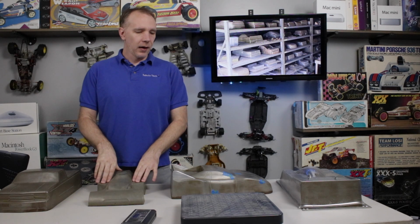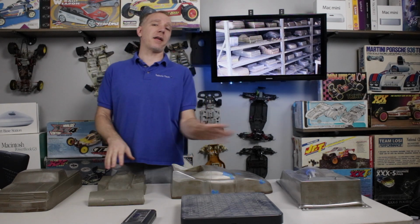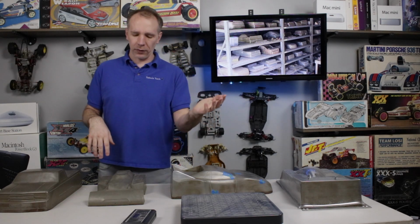Now, on YouTube, you'll see a lot of guys are doing plaster, and that's okay for small runs. If you're trying to do larger runs and you want something that's heat tolerant, you really want to do an epoxy resin like this with aluminum powder in it. And there's a lot of sources to get that stuff. I won't even list them because if you just do a basic Google search, you can find a lot. The only thing you want to make sure is you find something that's heat tolerant. If you don't, that's when you're going to get into trouble.